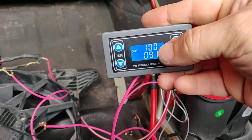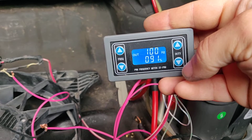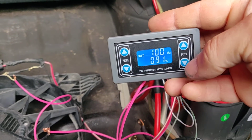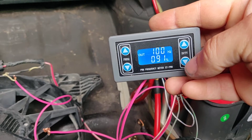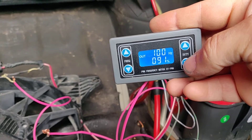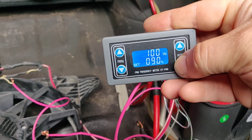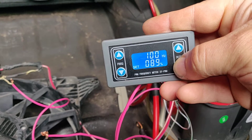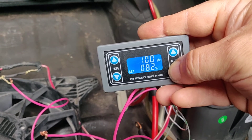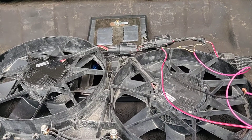The display here says 100 Hz, but the instructions say that the lowest frequency this can actually put out is 1000 Hz. And these fans are really looking for 100 Hz. So I think that's the reason it's not working exactly as it should — but they do work. It's a reverse duty cycle scheme where higher duty cycles mean slower speeds.